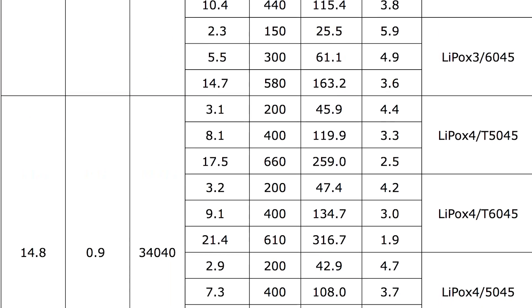We're going to be looking at motors. Motors come in a bunch of different sizes, and their sizes are measured using the size of the stator. So an 1105 motor is going to have an 11mm diameter and 5mm height stator. A 2204 is going to have a 22mm diameter and a 4mm height. Stator diameters in and of themselves aren't very useful — we also need to look at the power requirements the motor has: what voltages it's designed to run, what kind of prop sizes are good for it. Some motor companies will be nice enough to give you a data sheet with a few different prop sizes and brands showing how much power you can expect at full thrust, half thrust, and so on.